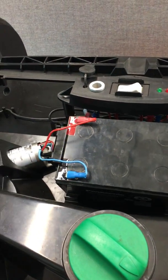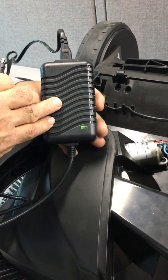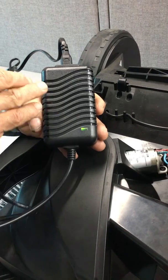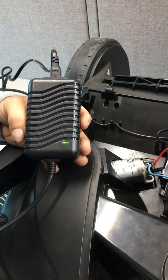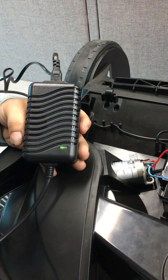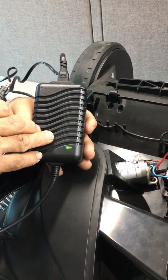The battery is still reading 12.7 to 12.8 volts. Now we're going to check for a dead cell in the battery. The charger for your BG or Hogg unit has a circuit board built into it — what it does is send a test signal to the battery to check the health of the battery before it begins the charging process.